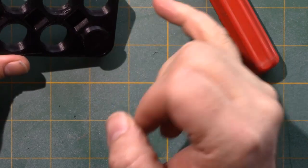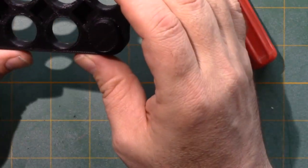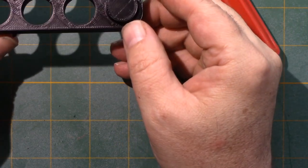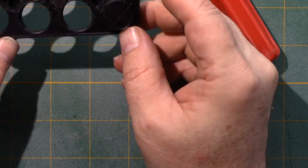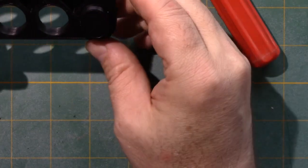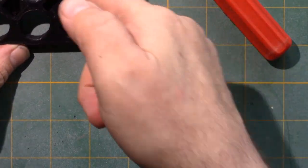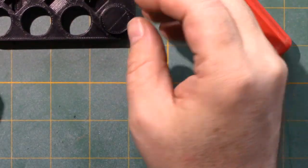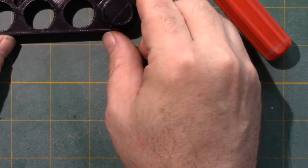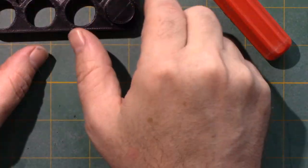What I should do is get my micrometer and calipers and see what the actual hole sizes are. I'm going to do that later. Next weekend, I'm going to print a high quality version of this, which is going to take about 3 hours. And I'll have this guy printed separately so I can stuff it into the holes to see which one it fits. The reason is when you want to make parts that fit into each other, you have to have clearances. And the purpose of this gauge is to determine, when you have two parts, how much clearance you need so they will actually fit together nicely.